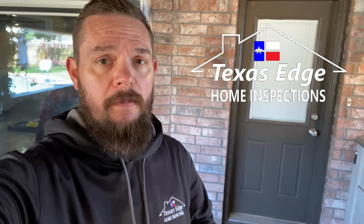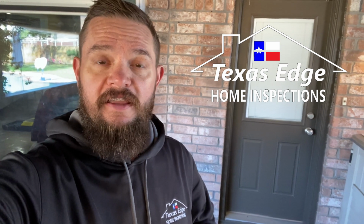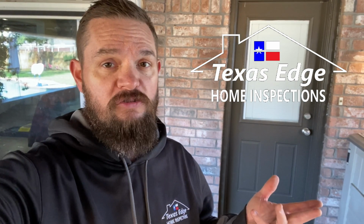Today I'm looking at a property that was built in the 70s. I'm going to take you around and show you some things that are possibly structural defects. We have some cracks in the brick and some separations. This could indicate that we have foundation issues, maybe, maybe not. Afterwards, I'm going to take you in and show you how I take some zip levels around the property to further determine if we have any foundation issues. Come check it out with me.